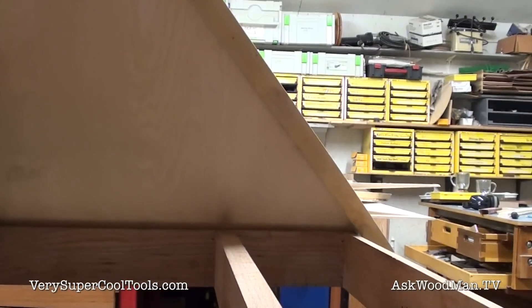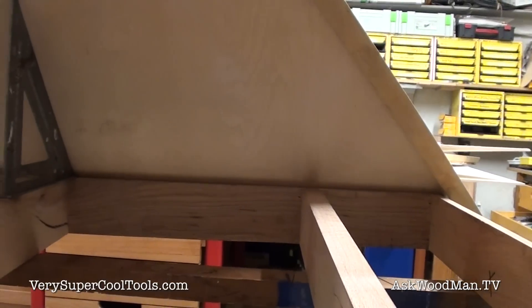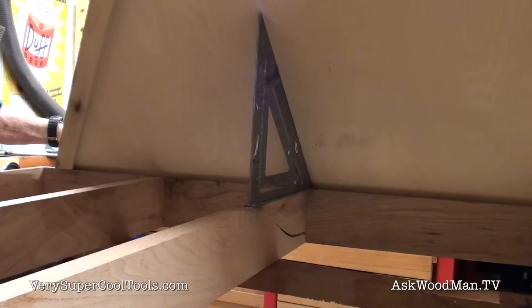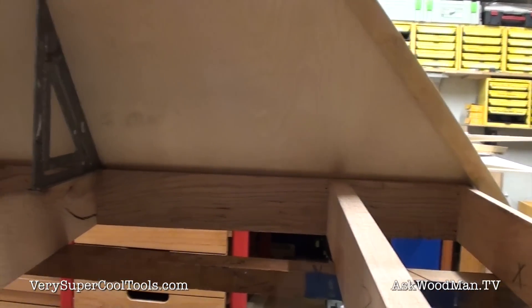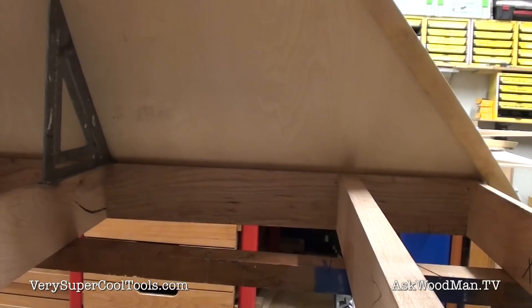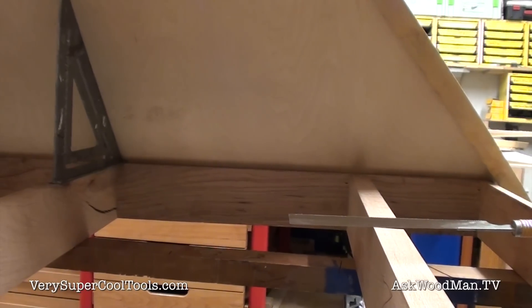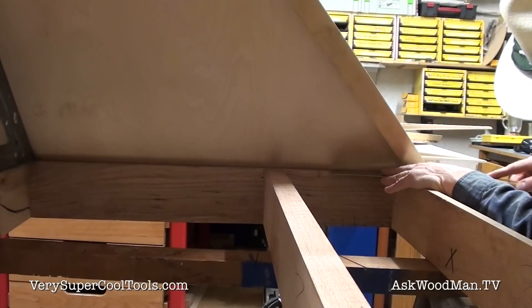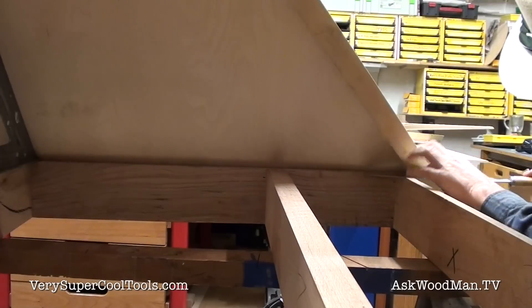Tony and I were working on our venturi. We've got the two long sides and the cleats. You first put the cleat on one side and trim it — you can't put both cleats on at the same time or you won't be able to use the actual piece as your template. I've got the second one on here running wild. Since we settled on a 45-degree slope, we can use the big try square and just cut it down with the handsaw. Then just use your Japanese saw to finish it off.